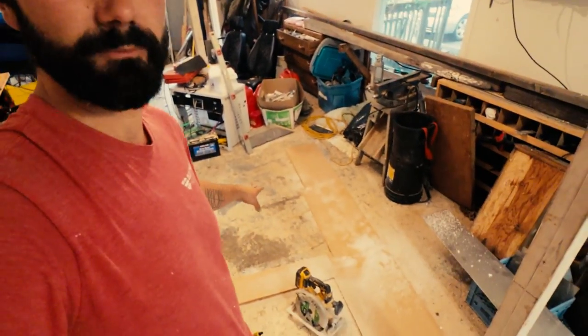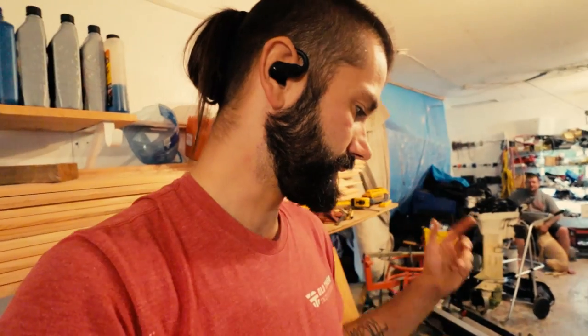Acrylic, ironically, has almost no bend to it, so if you're cutting it and the surface you're supporting it with isn't totally flat, it's really easy to crack it. Originally I tried to space it out with some pieces of wood, and I put some pressure in the wrong spot and cracked a piece. Luckily it was just an offcut, but what I did instead is lay it on my shop floor, set the blade to be about a 16th of an inch deeper than needed, and scored a couple marks into my already very scored floor. So no big deal. But that was the only way that I could support the acrylic fully while cutting it.